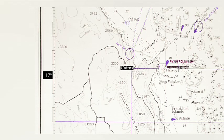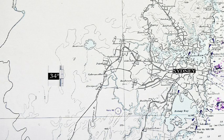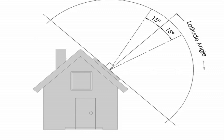This slide shows the correct inclination for panel mounting. Install the panels approximately equal to the local latitude. For example, Cairns is 17 degrees, Brisbane is 27 degrees, and Sydney is 34 degrees south latitude. If the angle is more than 15 degrees from the correct angle, 5% efficiency will be lost.